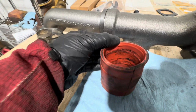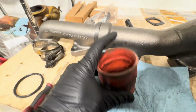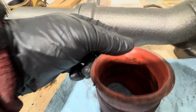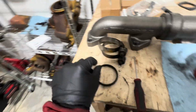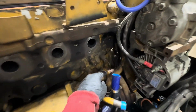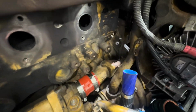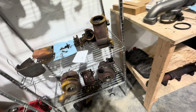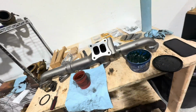All right, I got this coupling replaced, and it's a good thing it was, because there's numerous cracks in this. Replace the seal and the clamps. Some of those bolts in the back here are a little rough to get at, but you use a 1/4-inch ratchet and you can make it work just fine. So now we are on to getting some of these pedestals and bracketry mounted up, and we could see how far we could get with that.